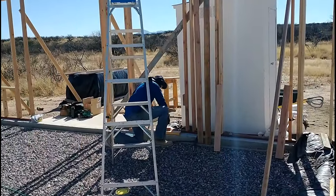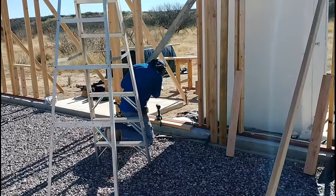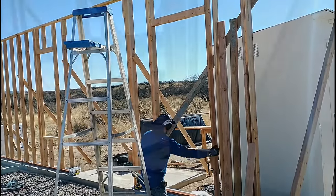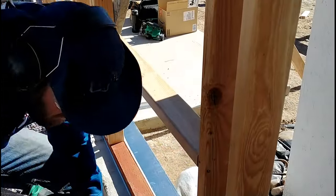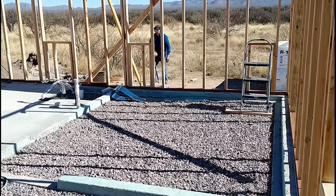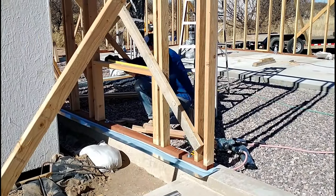I've moved on to the south wall of the house, which has the most windows including some pretty big ones. I started on the small windows — there are a couple that are 36 inches wide and one that's about 24 inches wide. For these I just used a 2x4 header, which I make by standing two 2x4s up on end and putting plywood in between. I quickly made those headers, put them in place, and filled in the framing around them, including the bottom sill and the missing studs on 16-inch centers.